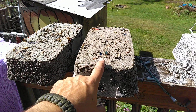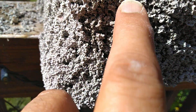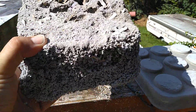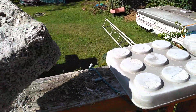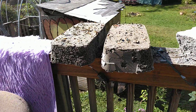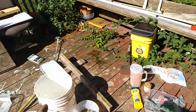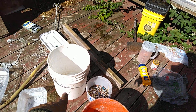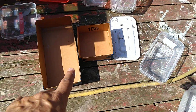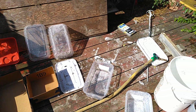A little bit more Portland — maybe I'll go three quarters. I'm trying to get an insulation-type mix. You can see here how the air bubbles make it look like lava rocks from your garden or barbecue. I'm trying to get it to hold together by itself and still be super light. This is obviously not structurally sound by any means. The process is: Portland cement water slurry for about a gallon, the rest foam, mix it with a paint mixer, pour it into molds. I'm going to try cardboard molds — it's typically free, you can find it anywhere, and if it can be used more than once, even better.